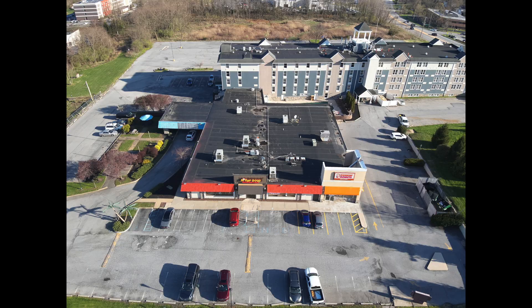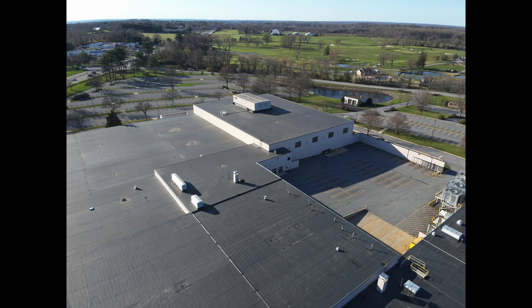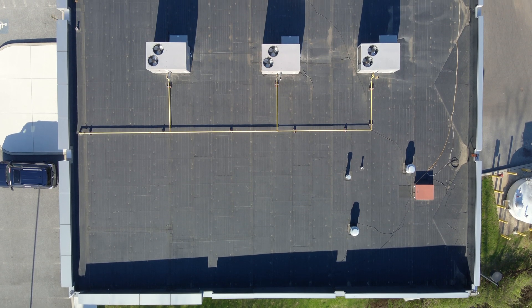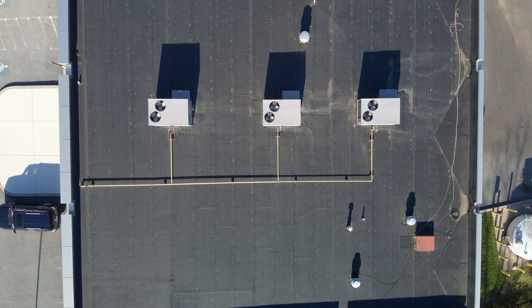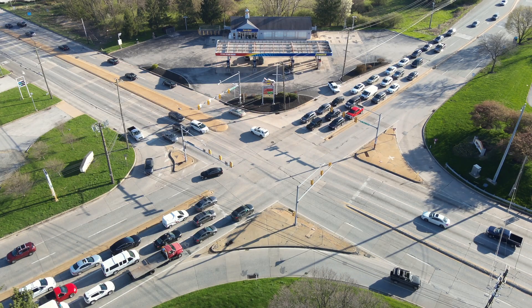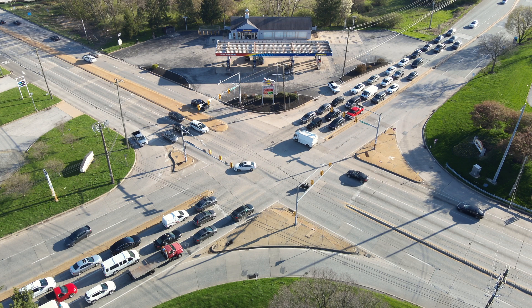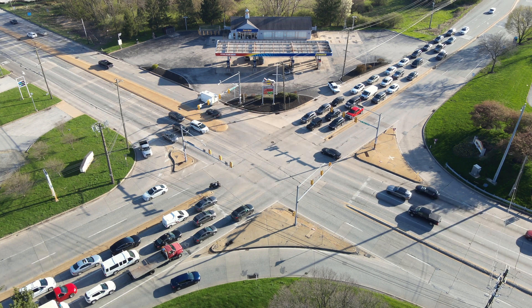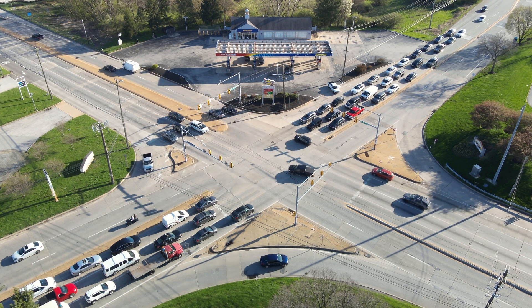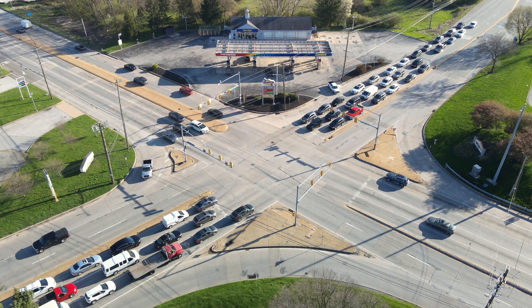The 4K video is great to have, but I probably wouldn't use the wide camera as a means of capturing data — that's going to be reserved for the higher megapixel zoom camera. Instead, the wide camera is great for getting around; I almost use it as a stabilized FPV camera to maneuver the drone. I also use it for capturing larger areas where it wouldn't make sense to use the tighter field of view on the zoom camera, like photos and video of entire structures or roadways.